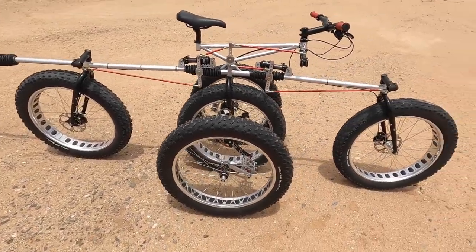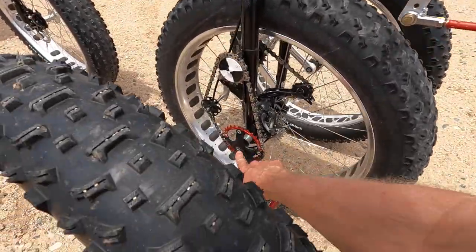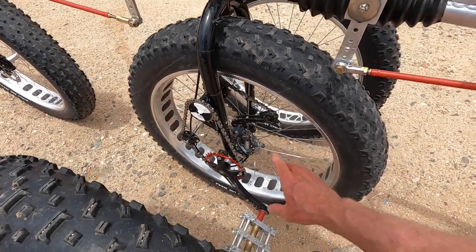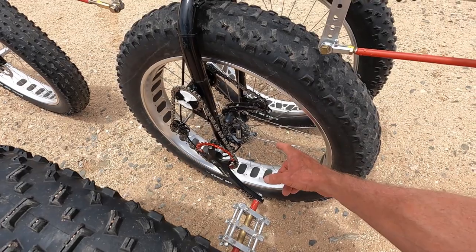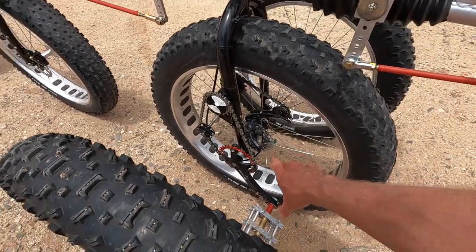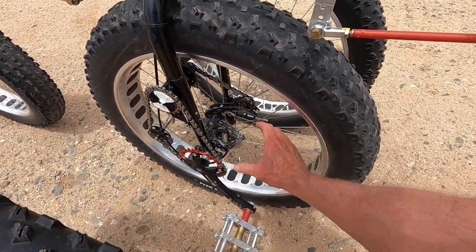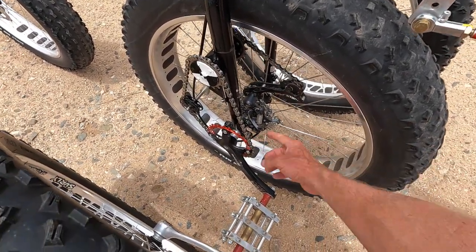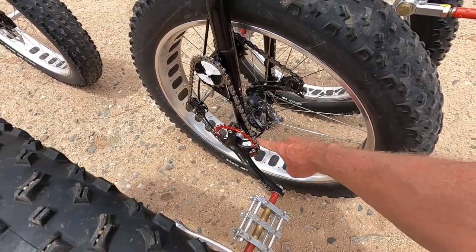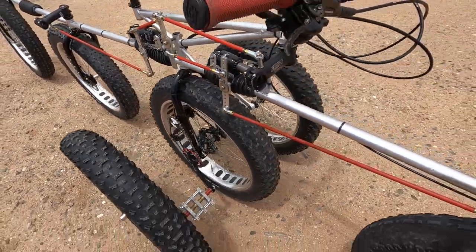Let's see here, parts, other parts, key components. A key component in here is the center axle. You can't see it because it's buried in there, but it's solid, and it carries the races for the hub. And then your cassette is on the hub, which is on that axle. It also has to have threading for the races, for the bearings inside the hub. And then from unicycle.com, it turns out I got these bearing holders right here, and these bearings, so the axle rides on these bearings,